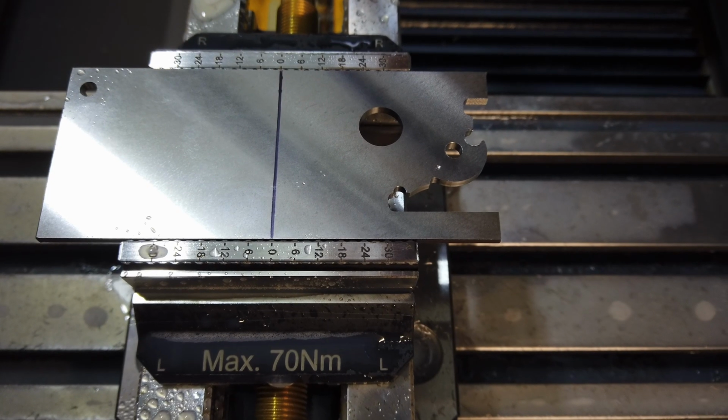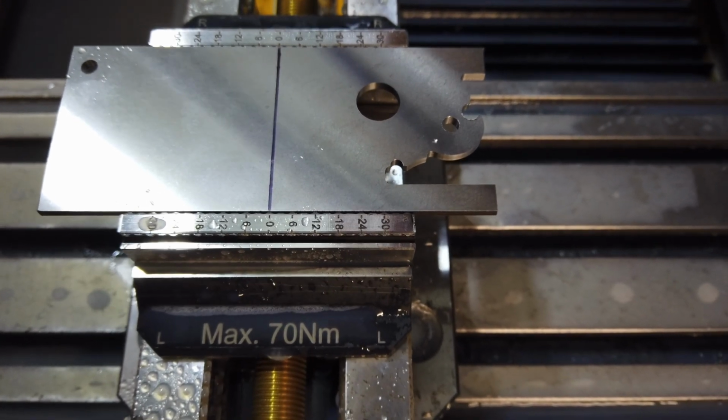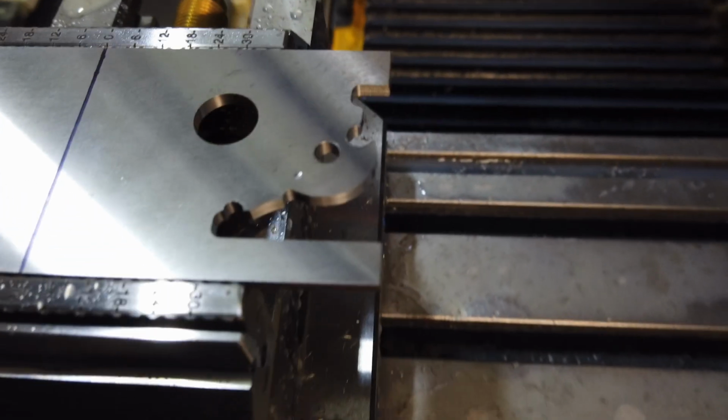All right, so let's talk about today's efforts. I demagnetized the blade before I put it on the mill, so I didn't have chips sticking everywhere. Milled out the blade, the tang first, with all the critical parts of the tang so that I can test the mechanism, and then finished window machining it out. There was one thing that I couldn't do on the mill, which was drill the detent hole. The reason for that is I just didn't have any tool holders small enough to hold the drill bit.